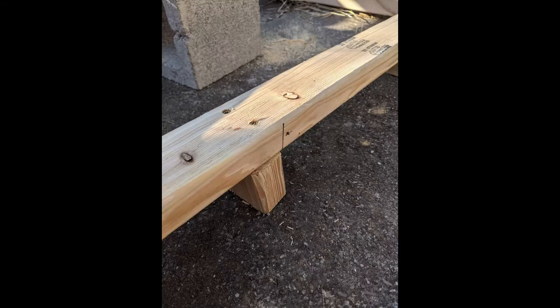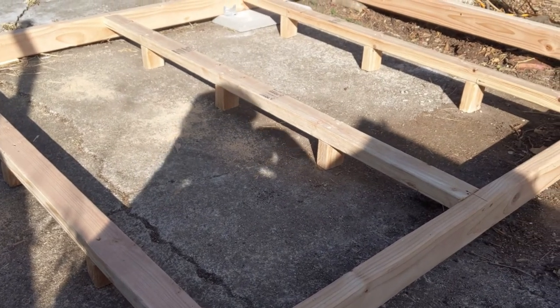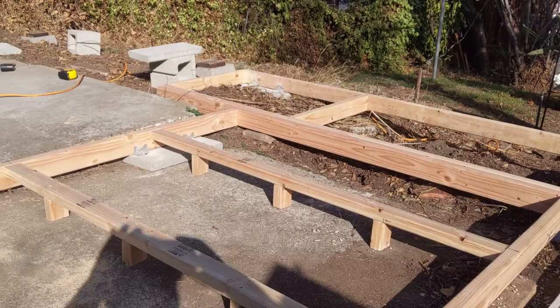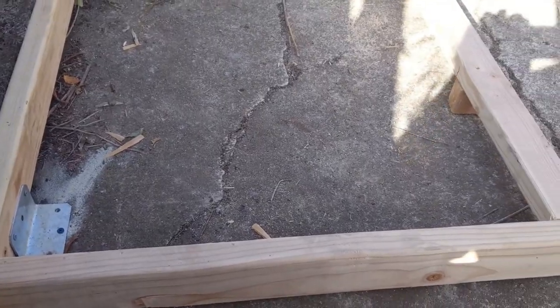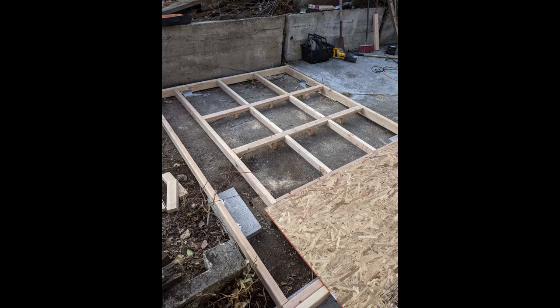To deal with the uneven slabs, I decided to build posts or stilts underneath the 2x4 frames to help level out the platform structure. This allows me to use the main slab as the base for all the heavy gym equipment and build the frame out from there to make the platform the right size to fit the carport structure. I took thin flat cement blocks and put them under the edges of the framing to give them a solid base and leveled them to the other slab. I anchored them with metal angle brackets and cement screws, and in places where the 2x4 frame was level with the slab I screwed in more metal brackets to both the slab and the frame.